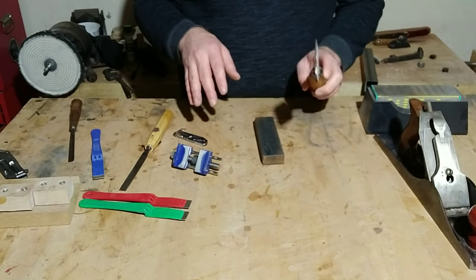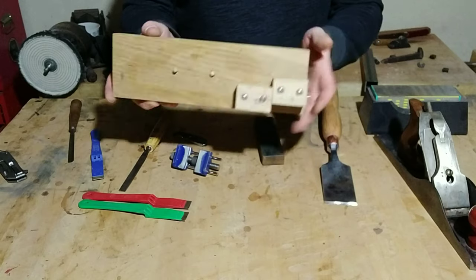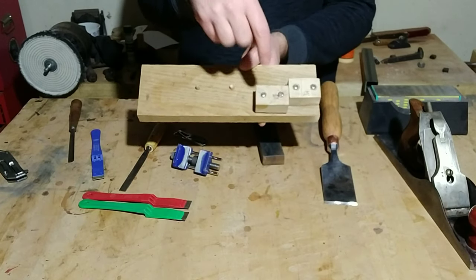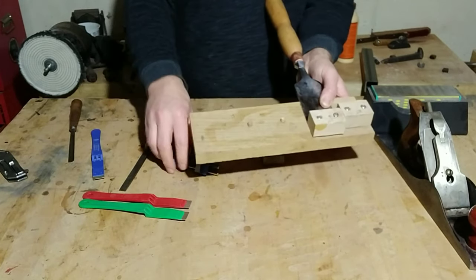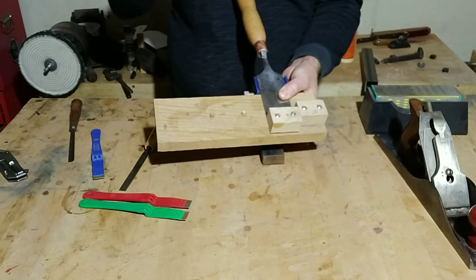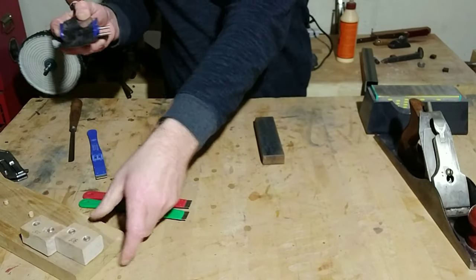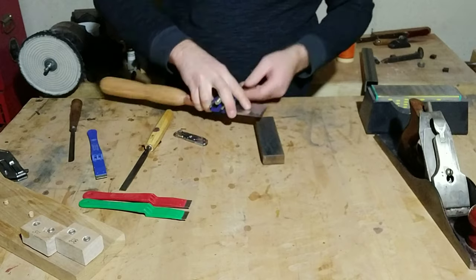One thing I forgot to mention for chisels and planes: you can set up a jig to get the perfect angle every time. I know the distance from the end of this block to these reference blocks gives me a specific degree every time. I've got a 25 and a 30 for different applications, though I primarily use the 25. You just get the chisel right up against that block, put the honing guide on, make sure it's completely square, lock it in, and you've got 25 degrees every time. The guide also still allows you to flatten the back edge since the chisel sits at about the same height as the plane iron.